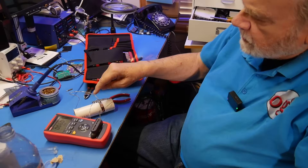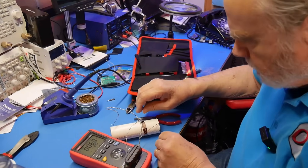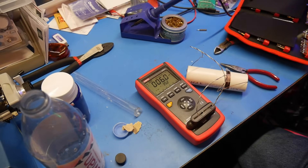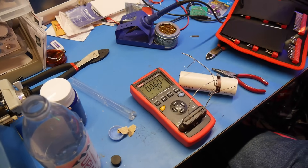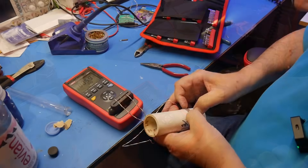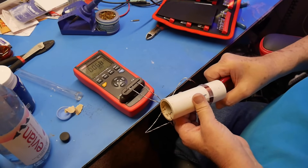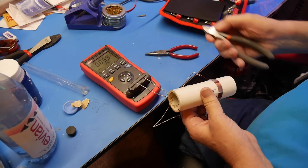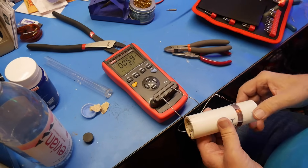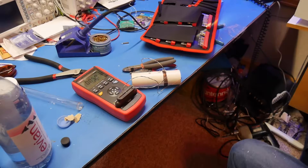Now there are issues with the coil. I don't have the windings right up on top of each other, and that will make a difference. I'm getting six microhenries, which is half of what the calculations said. I don't see a big problem with that because this is a very jury-rigged setup. Now here's something that's going to make it change — I'll put this metal thing in the middle. It changes it a little bit but not much. So this is measuring as a six microhenry coil in 11 turns.